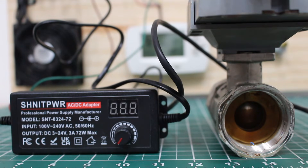The way this works is that when we have no DC voltage, or 2 volts DC — because this is a 2-to-10 VDC actuator — 2 volts would be closed and 10 volts would be fully open. The way this modulates is: at 2 volts we are fully closed, and as we increase the voltage the valve will open accordingly. So at around 5 to 6 volts we should be in the halfway open position. As voltage increases on its way up to 10 volts DC, the valve will open accordingly.